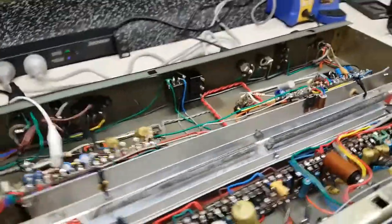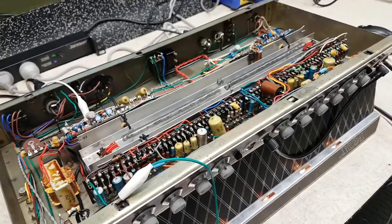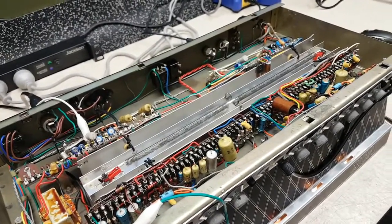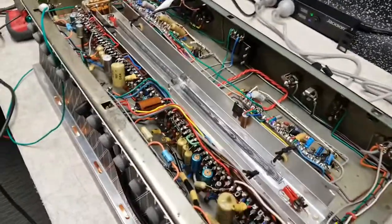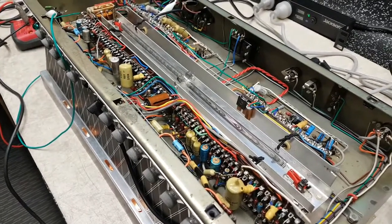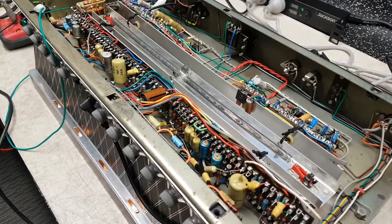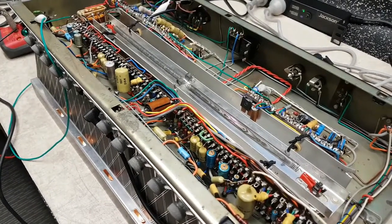What's unusual is the use of the piezo pickups. At the time, a patent was held by Hammond about the use of magnetic coils to drive the spring and to pick up the signal off the spring. I think they were charging something like a dollar or a pound for use of that design in amps. Vox didn't want to pay that, and so went out of their way to design their own pickup and driving system to save that dollar. It makes it a pretty unique sounding spring reverb, that's for sure.